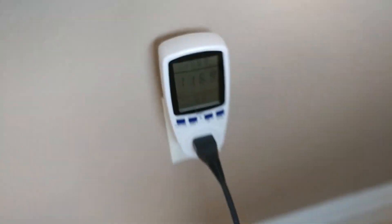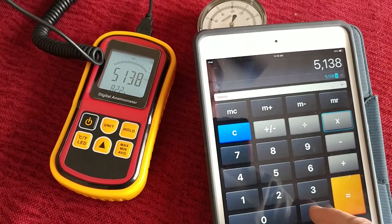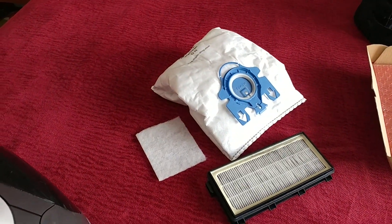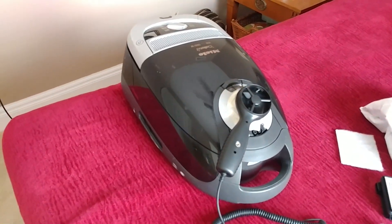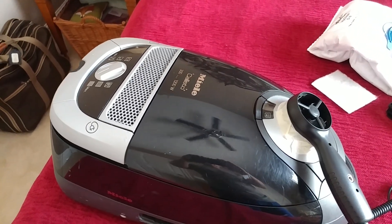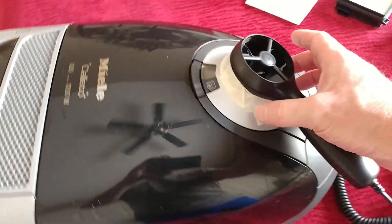I'm going to go all the way up, and we're at almost 117 volts. 134 CFM, no filters. Just a reminder, this machine's from 2012. To me it sounds like probably time for new motor or new bearings — really just probably needs a bearing repack. Light and/or ungreased bearings usually run a little faster than fully greased bearings, so 134, and that is about as sealed as I can get.